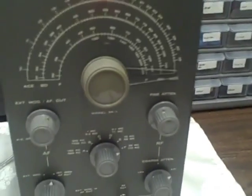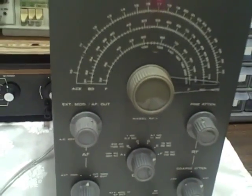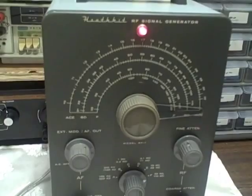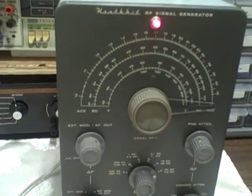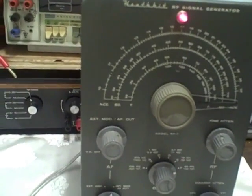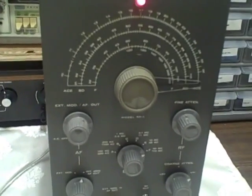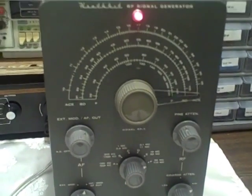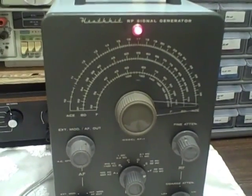One flaw in the ointment with this unit: the RF output tracks very well and is clean, but there is no modulation coil — the modulation transformer that should be inside this unit is missing. Somebody along the way took it out; I wasn't told it was missing when I bought it. You will not be able to get the 400 Hz modulated tone, and you can't modulate an external signal unless you're able to come up with the modulation transformer. It's not hard to install — only three wires and a couple of screws — and in most cases you won't miss it. RF-wise: excellent. Modulation: no.